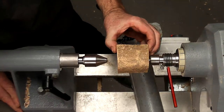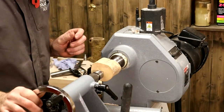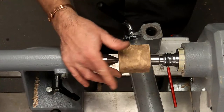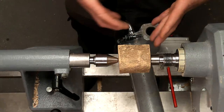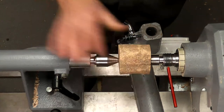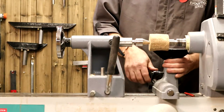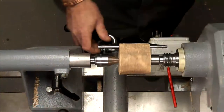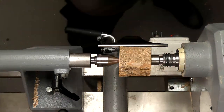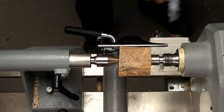In the tailstock I've got the ring centre I like, which provides a lot of pressure. Without too much pressure, if I back off the handwheel I can spin it by hand to see how it centres. Frederick, you asked last week about whether the spring pressure works against you - actually it helped me centralise this. Then I tighten it up and lock it in. Short tool rest. Turn it over by hand - sensible with a non-uniform shape. We can drop the lathe speed down, making it easier to start rather than having to panic and turn the speed down. Safety glasses on.